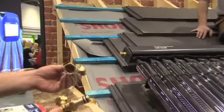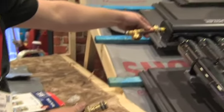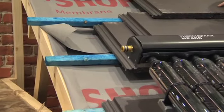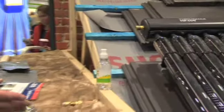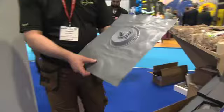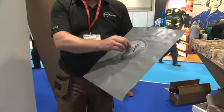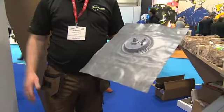And we have some special fittings here for this. I'm not going to fit them on because they're a devil to get off again. But these will connect onto some solar pipe which goes through into the roof. Now, what I said earlier about maintaining the structural integrity of the roof is just as important here. And so we have some proprietary products. This is a flashing made by Dex. We'd remove a tile, put this in instead of it, and make the penetration through this latex seal. That's how we get the pipe into the house without letting the rain in as well.